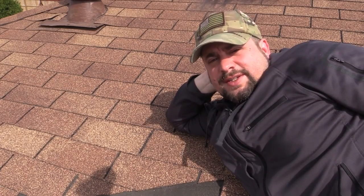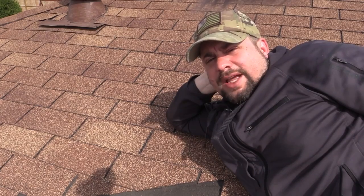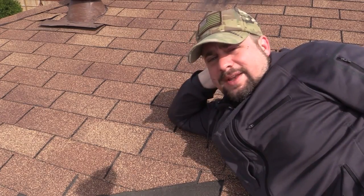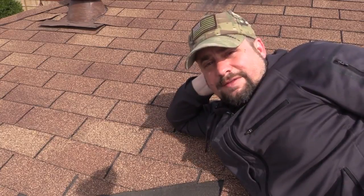The first thing you have to consider is the age of your roof. A panel like a Renogy is going to last you a good 25 years, about the same lifespan as this roof. How old's your roof? Unless your roof is brand new, you'll be removing your system at some point to repair the roof. I guess if the grid went down tomorrow, it wouldn't matter, but there are 2 more reasons you might want to consider otherwise, and both have to do with efficiency.